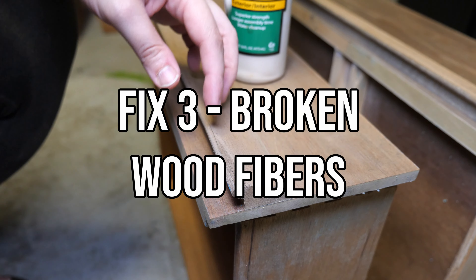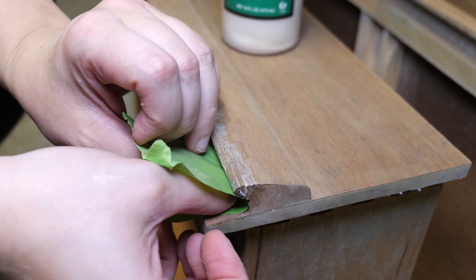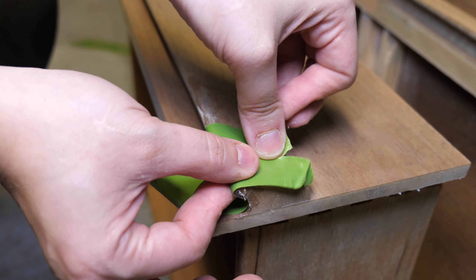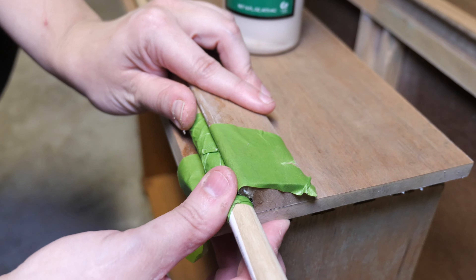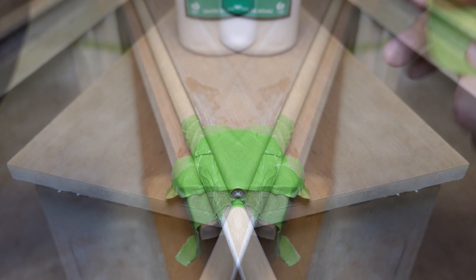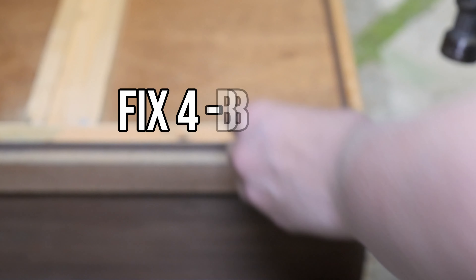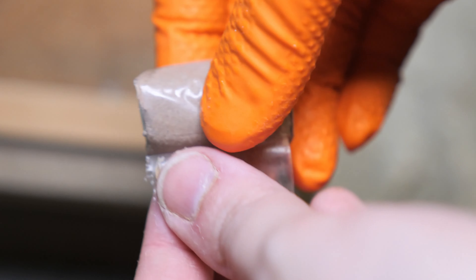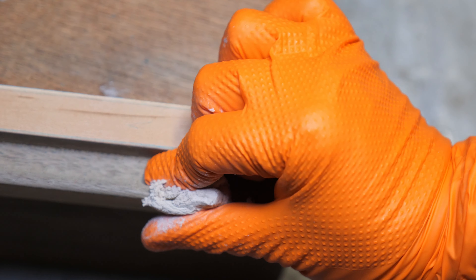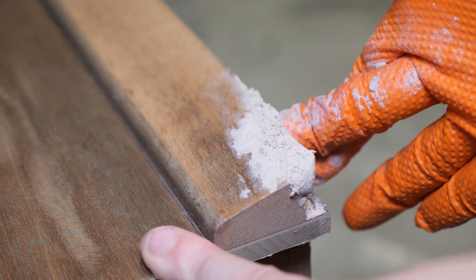One of the drawers had what I originally thought to be a sanded down spot on the corner, and it ended up being that the wood fibers were just split apart and compressed. I ended up applying wood glue to the cracked wood and then taped the piece back together, using a piece of dowel to help support it while it was drying. The top left drawer handle had a large chunk of wood missing from the corner. I used quick wood to repair this damage and added two nails to reinforce it. I spent a good amount of time molding the quick wood as close to the shape of the broken handle as possible — this stuff dries hard, so having less product is better because that's less sanding later.